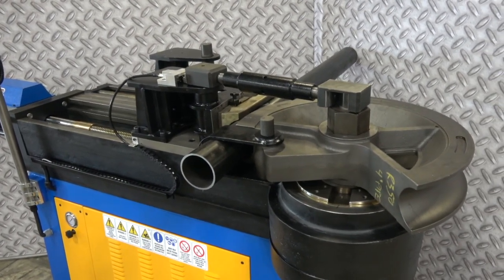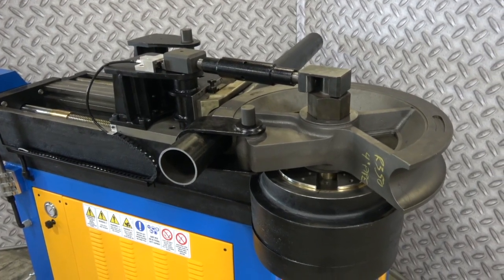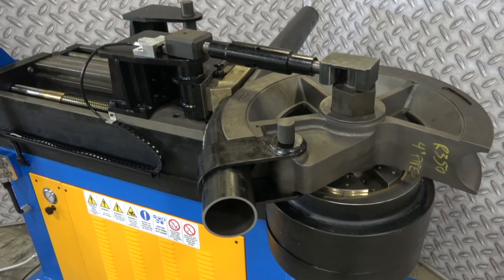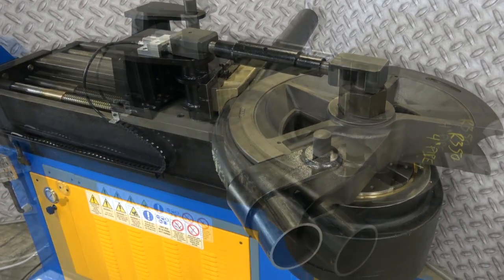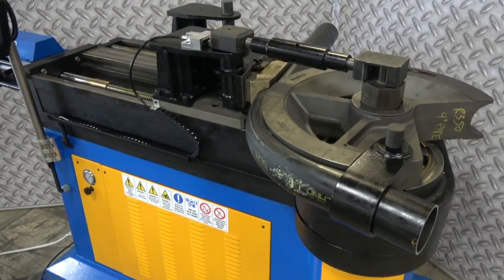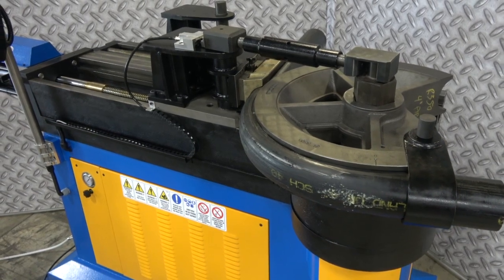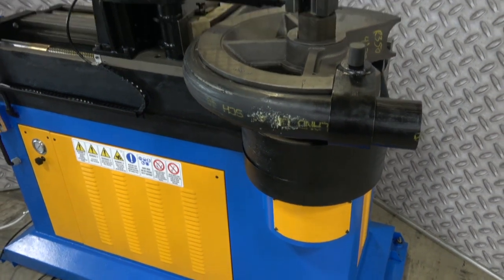Plus to confirm, now we're going to run C-axis. C-axis is going to rotate, we're going to make a bend here. A lot of force required to do this kind of bending folks — Ercolina can handle the job. Alright, we hit 90, we're good. It's going to release some of that spring back for you, a real nice operation.